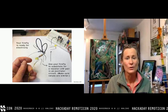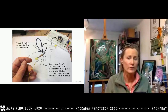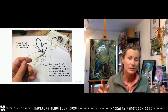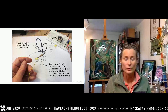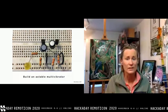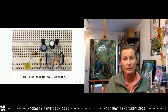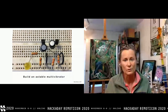At this point you've got your firefly, your ground lead, and your power lead. If you plug this in, it will light up but it will not blink. If you want it to blink and you have a breadboard and feel comfortable breadboarding some form of oscillator — this is an astable multivibrator — Mohit is going to show you how to build an oscillator using a 555 timer. There are numerous ways to do this, but anyway, this is one. If you want to add detail to your wings, you can use your jigs for that. If you want to get really advanced, you can put your astable multivibrator actually in the body of the firefly.